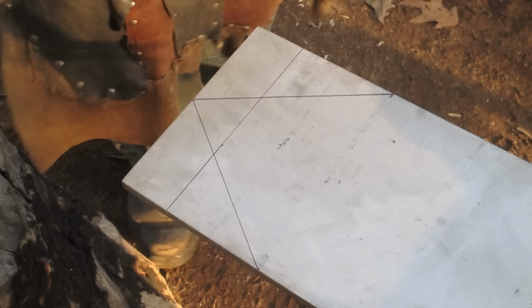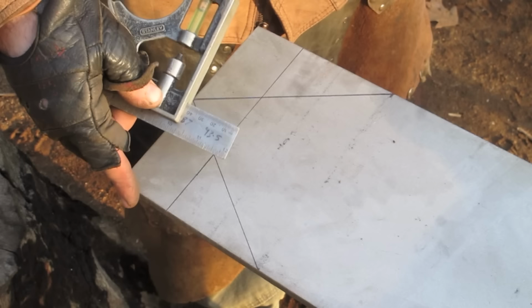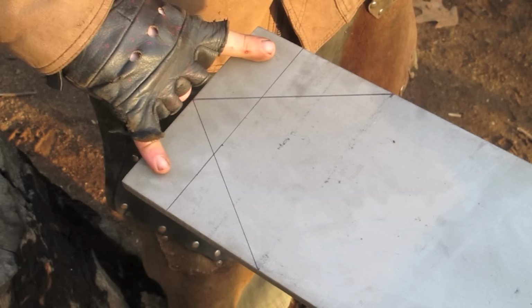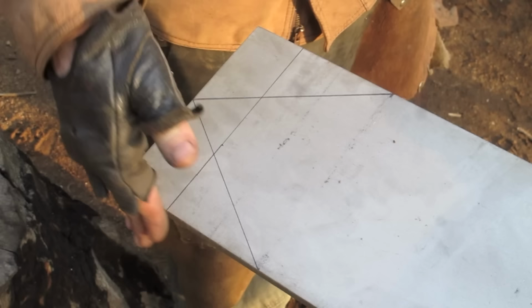The edge of this plate, where it was cut, has a little divot, which meant measuring the exact center was a little bit hard. So sometimes when I have to deal with the edges of plates being off, I draw a straight line across, and these two sections are both exactly 61 mil, without being planned. I could have drawn anywhere, and just see whether the two line sections were the same length, and they were. The corners on plates often get weird if you're trying to get a measure from them.